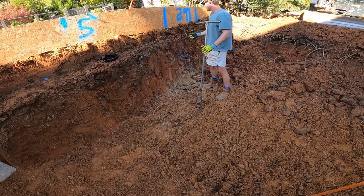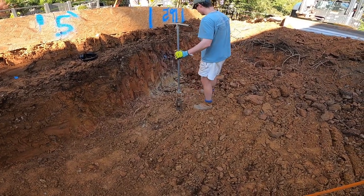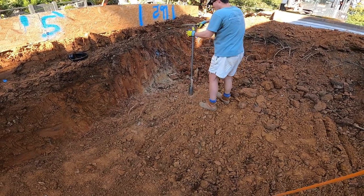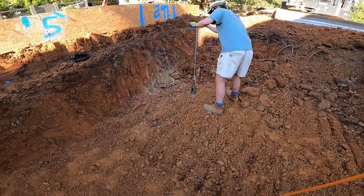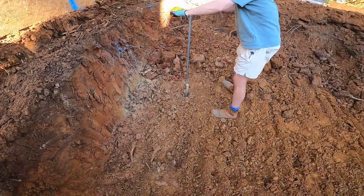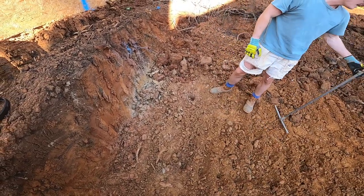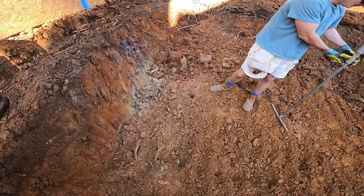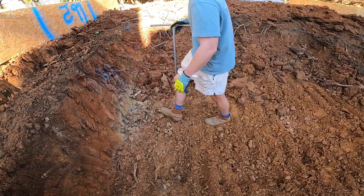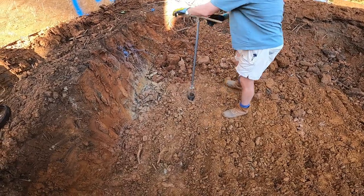The thing about bull tallow is that it sucks digging. If it's just that little area, I don't think it would make too big of a difference, but you don't want your entire house footings on the bull tallow. It's not the best because it will contract and expand when it gets wet, with the cold and water. It'll crack a foundation, won't it? Yeah. A lot of times you'll get it even pure. We've seen worse than that, for sure.